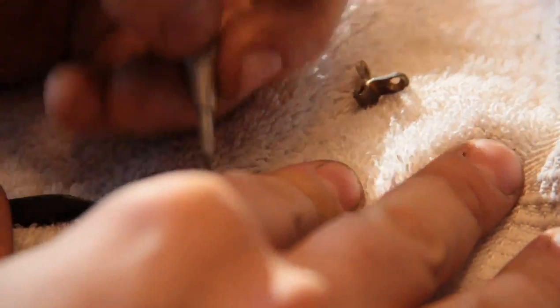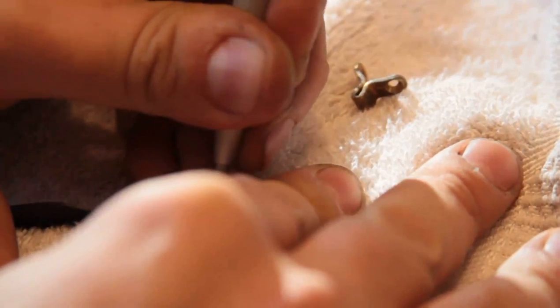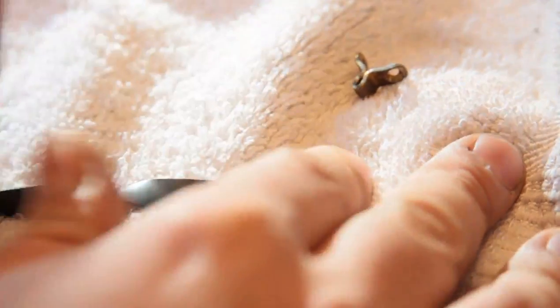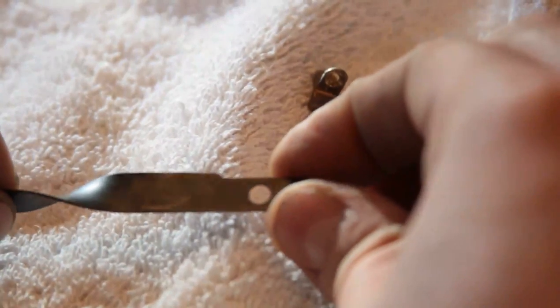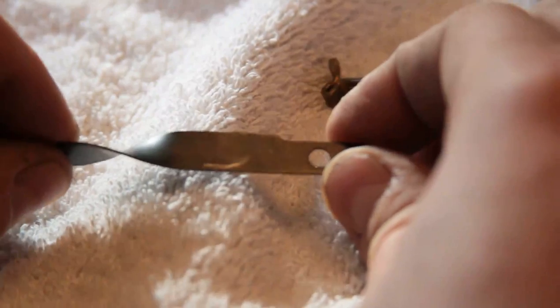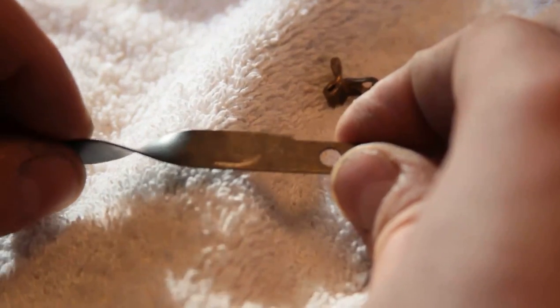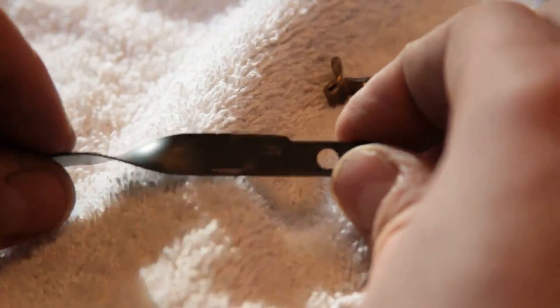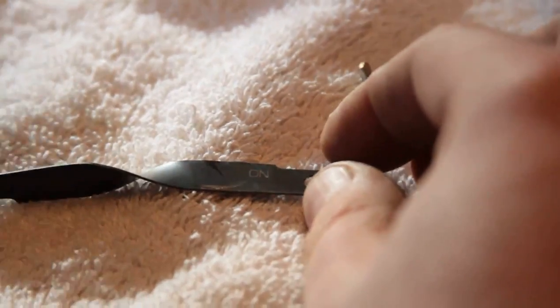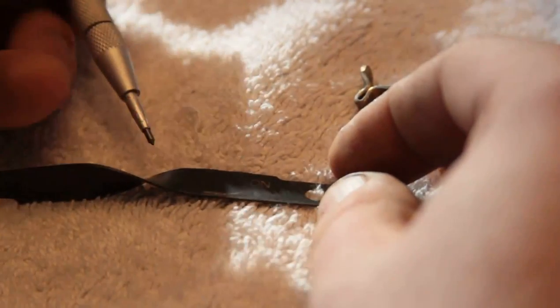And that's actually etching the metal. You can feel it. If it doesn't etch enough you can go over it again. I think this may be a little bit dull so I need to sharpen it on a diamond stone, because it will dull a little bit. But you can see how shiny the cut is in there, so that's definitely making a mark that will stay even after you get it dirty — Sharpie will run off and stuff like that. So pretty handy. Also makes a good pointer in your videos when you're pointing at stuff.